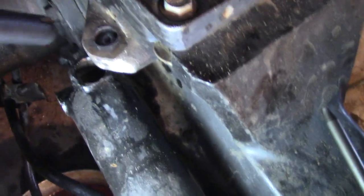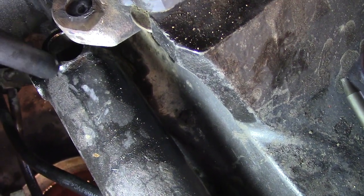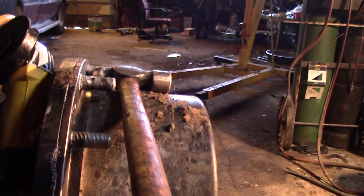Here's where the steering cylinder pin goes through, and the bushing goes down inside the steering cylinder. If you look down on the bottom, a little bit of that pin protrudes. I got my tall jack wedged in there and started pushing on that pin, and I just lifted the tire on this side off the ground.